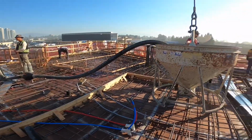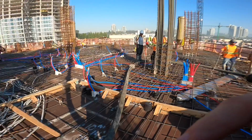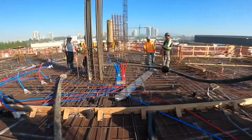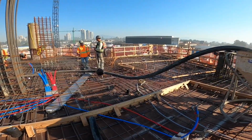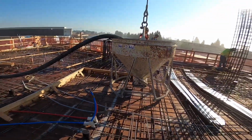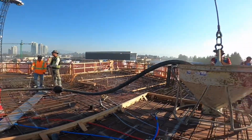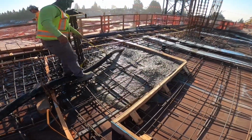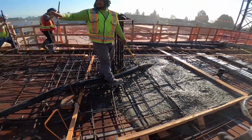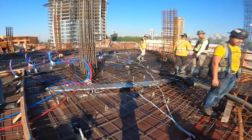But yeah, we're going to prime the grout into the bucket here, as such, not to dump it all on the slab. We've had issues before pumping the grout directly onto the slab, with some inconsistencies once they strip the deck. So from now on, we just put it right into the bucket here. Anyhow, we should be priming through here very shortly. All right, we are through, rocking and rolling. Nice juicy slump. Only 199 yards to go.